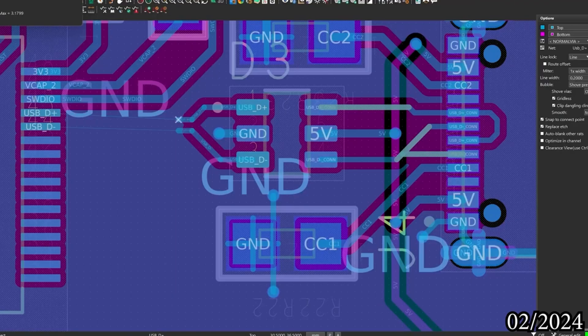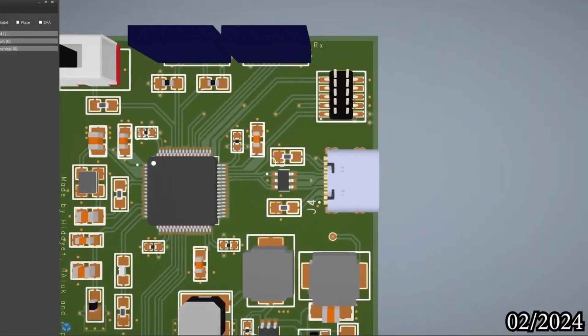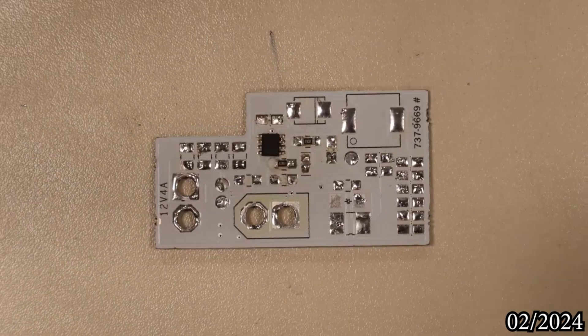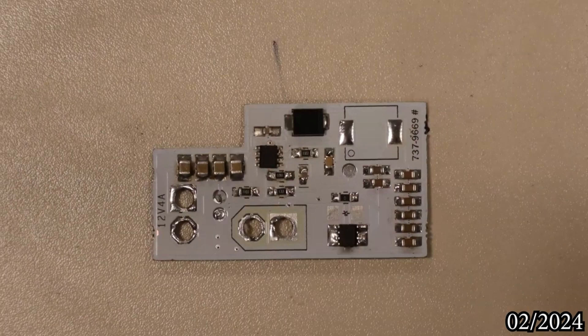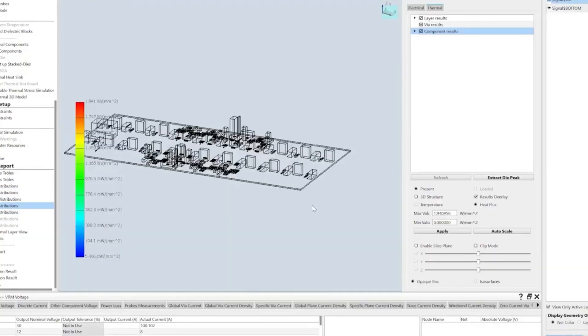The design philosophy prioritizes ease of replacement to improve redundancy and adjust voltage levels. All power electronic designs undergo rigorous simulations for compliance with IPC standards, guaranteeing reliability and safety. The team developed STM32 boards with CANbus for seamless integration with essential rover systems. In response to changing power requirements from modifications to the robotic arm, the batteries were transitioned from a 7S8P to a 6S8P configuration.